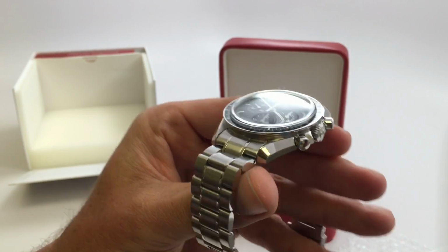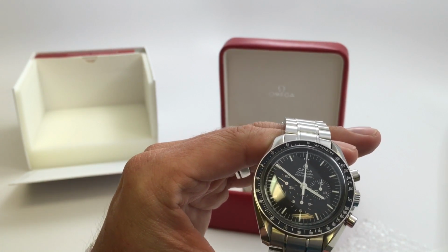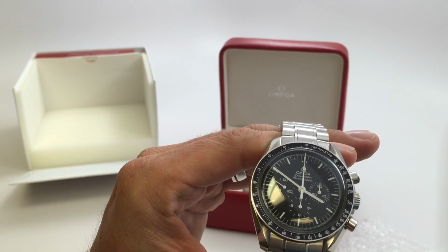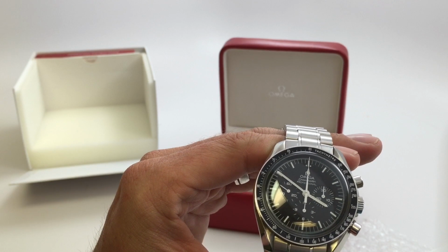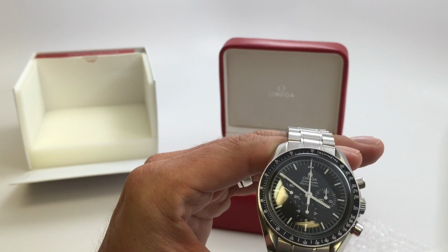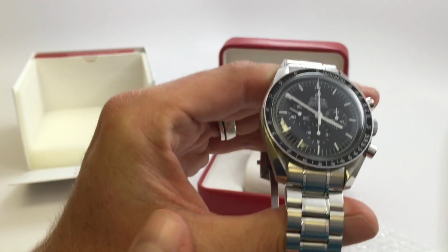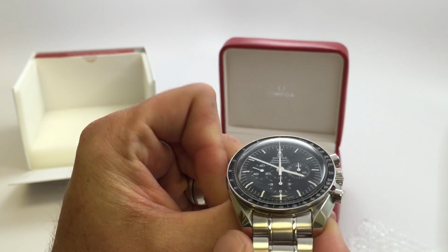That's really high for those that don't really know relative humidity terms. I think my air-conditioned room here is around 60% humidity. Number 5, oxygen atmosphere. 48 hours in an atmosphere of 100% oxygen at a pressure of 0.35 atmospheres. Number 6, shock. 6 shocks of 40 Gs, each 11 milliseconds in duration in 6 different directions.